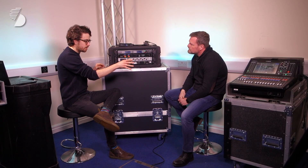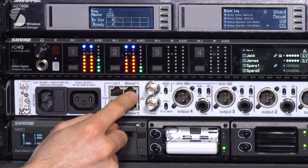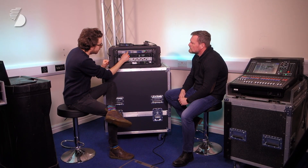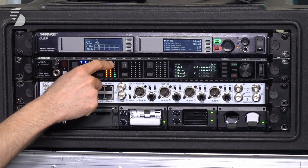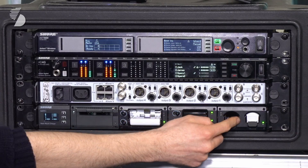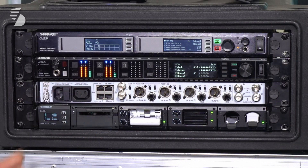So as we said, Yamaha wants to see primary Dante and control on the RJ45, so one port obviously has to be reserved for that — remember all four ports are putting out everything. The network starts with the laptop controlling most things, which plugs into our spectrum manager at the top. We then daisy chain out of that into the first port of our receiver, and then take a daisy chain out of this port to go to the SBRC controller at the bottom. We then need a PoE port for our AD610 access point — this unit requires power and it can work on PoE. So out of one of the PoE ports here we're sending a Cat5 to the AD610, and that leaves us with just enough ports to have an RJ45 going to our QL1.